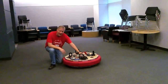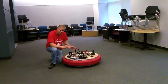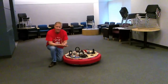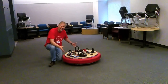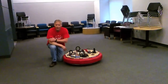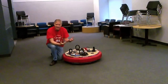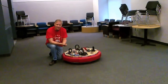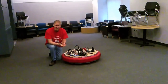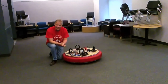We've got BaneBot VersaPlanetaries, our WildSwerves, sensors on all these different things, and a sensor that tells us what field-north is. The other part is making this a virtually difficult-to-pin robot. It's 12-sided, but from a practical point of view it's almost round, and we think it's going to be hard for people to pin. Hats off to Cheesy Poofs for telling the world about experiments they've done with sailcloth as a FIRST-legal bumper material. We've ordered a number of different sailcloths, found the slipperiest one that's FIRST-legal, and we think if you want a robot that can get out of friction pins, we're really on to something.